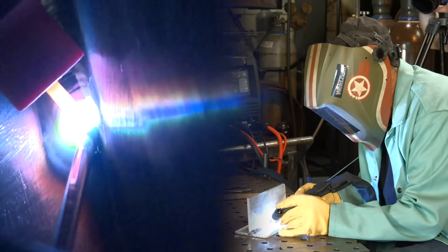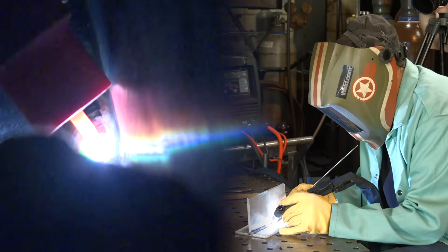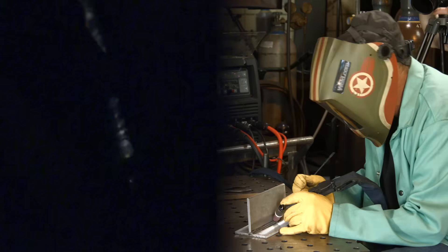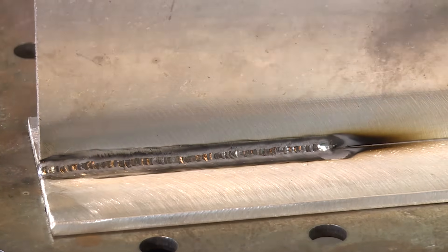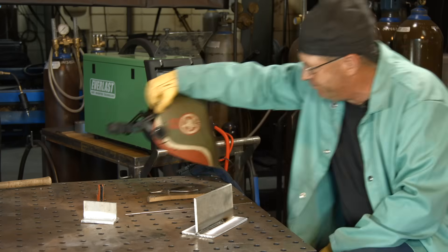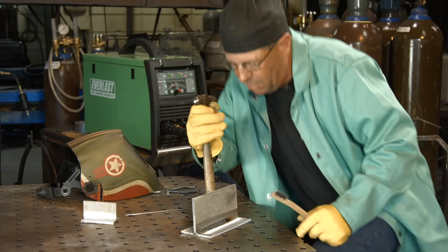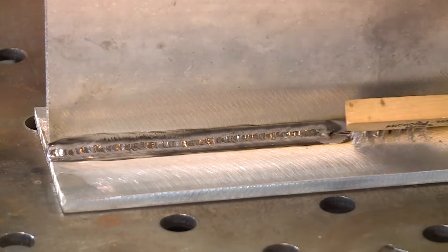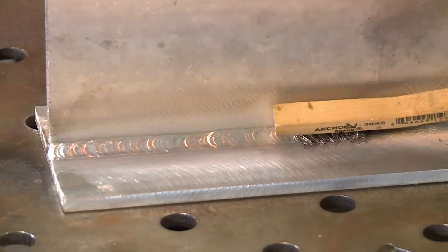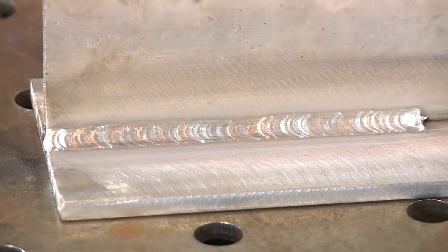Very strange looking arc — a lot of black around it. It just looks strange, looks real weird. The profile back away from it doesn't look that bad, but with all the black around it, it just looks odd. So watch this — let me get my heater beater thing here so we don't burn our fingers. I'm going to take the stainless brush and, booyah, take all the old black soot off of there — and a decent looking fillet weld.